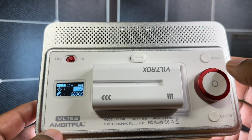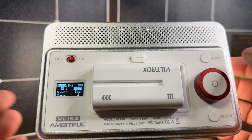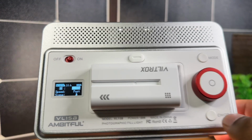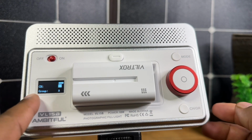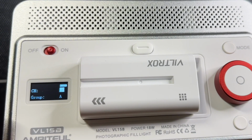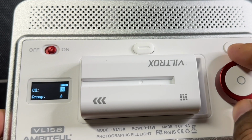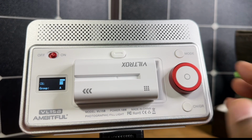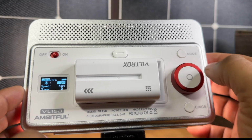So if we change that mode real quick, we can go to our CCT. We can change the mode back and forth between scenes by just pressing this mode button. And as far as our channel settings go, you'll be able to switch this. Like right now, this is on channel 10, group A. You can adjust that. So if you wanted that to be on a different channel, you can adjust the channels right here. And this is going to correspond to your app that you're going to use to control this.